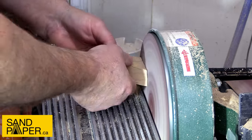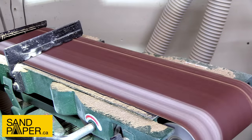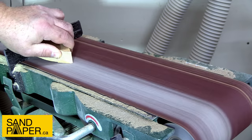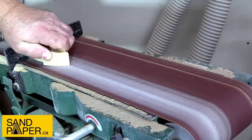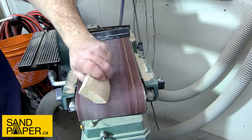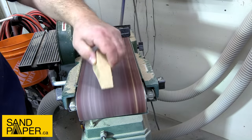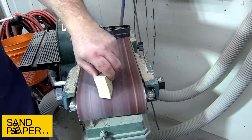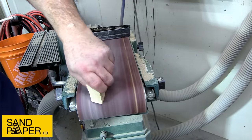The problem is it leaves behind a pretty rough cut, so it's important to clean that all up, because if you don't, you'll see that in the final casting. And along with that, I'm going to grind down the tenon that was on the bottom of this, because I need these pieces to sit right down inside of this plastic bowl that we're going to glue these to. And it was important to get rid of that tenon in order to do that.